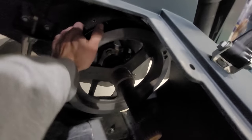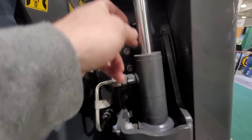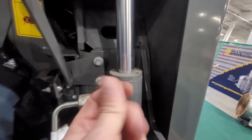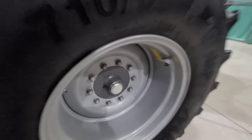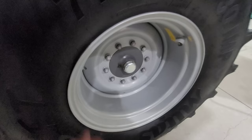This pulley would always leave us — always. We had to replace this shaft. I don't know if they changed the tilting pressure, but we could never tilt with our headers — and it wasn't because our header was too big. They put a poly pad in back here and just didn't have enough pressure. Once that gets some dirt on it, in oil seeds it's slippery so no problem, cereals not bad, but pulses? You're never going to get it to move. You'd need three people jumping on the back to help you calibrate it. And we were always losing dust caps — put new ones on, lose them, put new ones on.